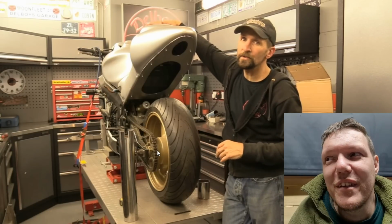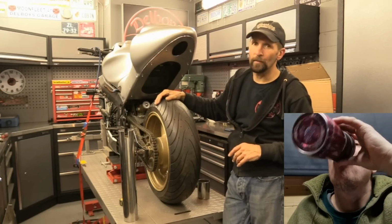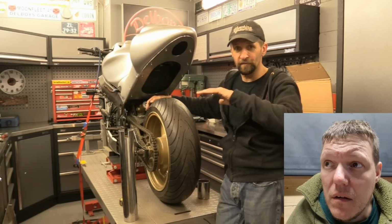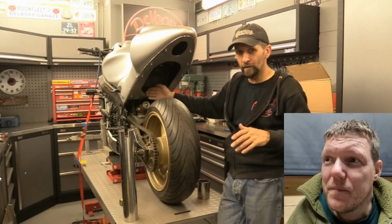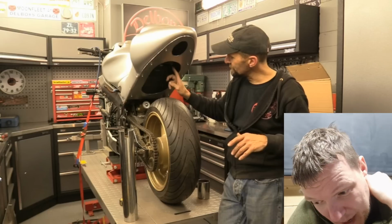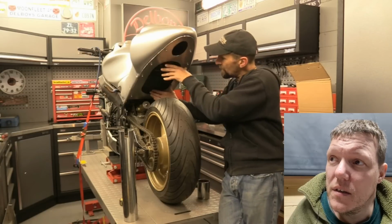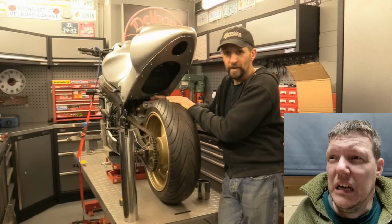No, that was before you put filler on it. Just under 5 kilos for that. I don't think that's a kilo on its own, not at the moment. It doesn't matter. Point is, I've got to get another little bit for underneath there. I'm thinking, like I said, of getting some sort of trailer mudguard or a Harley Davidson fender, something that's got a pre-made curve, another petrol tank, a nice round pre-made curve that I can just put inside of that. If you're not a panel beater and you don't know what you're doing, it's a good option. Trim and cut and fabricate to shape so it fits up in there, and then grind the lip, weld it round, grind the lip back so it looks like it's all one piece, which is absolutely fabulous.